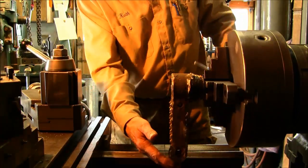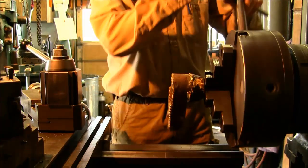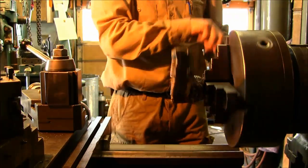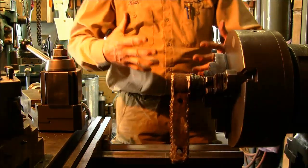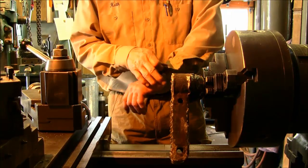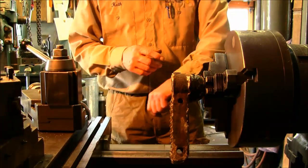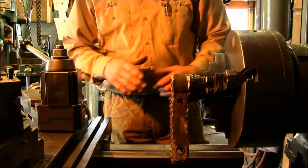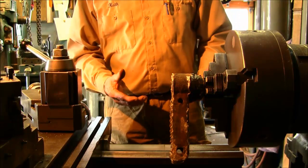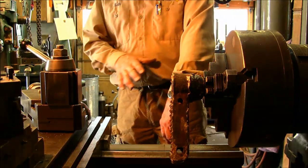Alright, and we can swing this in the carriage. You always want to make sure that the items you're putting in the chuck are going to clear your carriage and everything else around. And also make sure that you don't have any loose clothing. I wear long sleeves from time to time. It's about time to shed this off and start wearing short sleeves. But I wear tight cuffs. Alright, no rips, no bags, nothing that can get snagged. I don't roll a cuff and keep that out here.